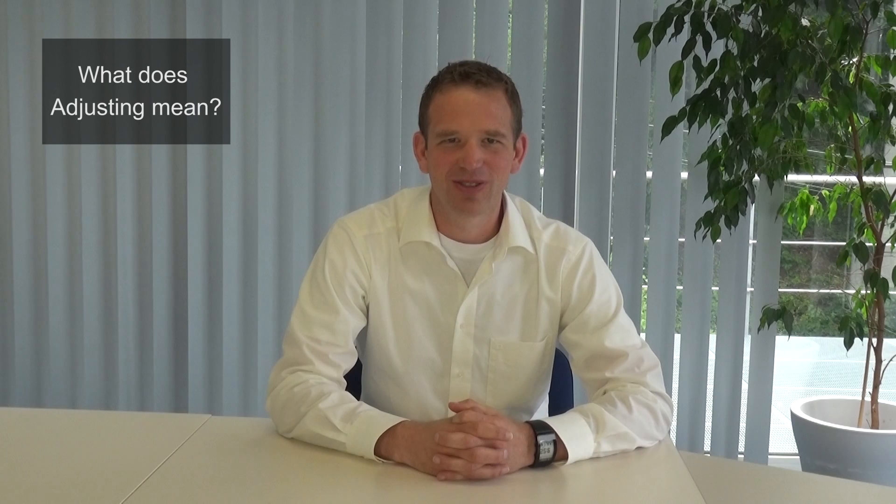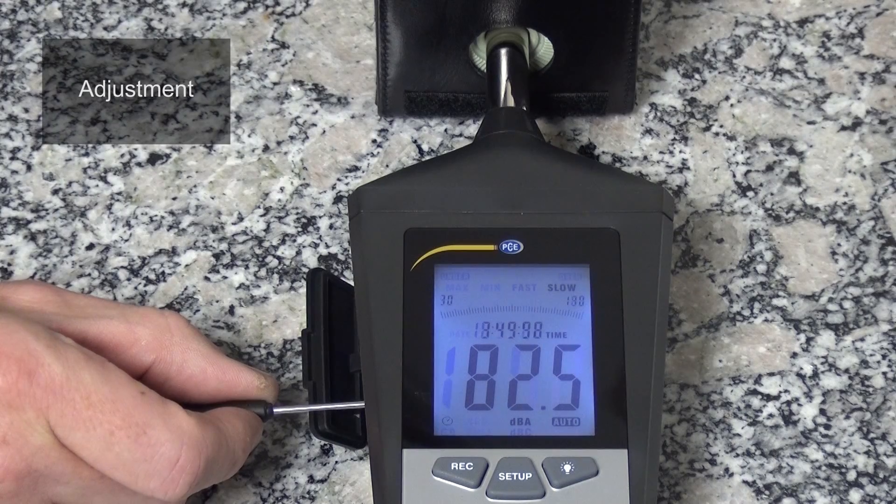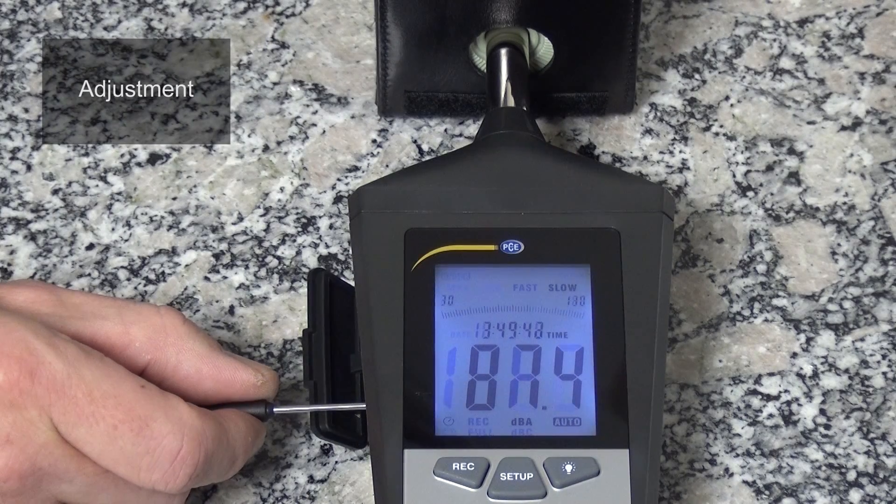That is all on the two themes, verifying and calibrating. Another often-asked question is: what is an adjustment? An adjustment often goes hand in hand with a calibration. Calibration is, as we have already learned, the pure inspection of the SET and IS values. Should there be a deviation, the IS value can be adjusted — this process is called adjustment.